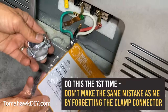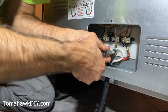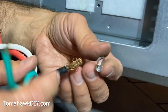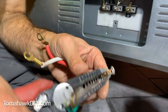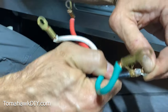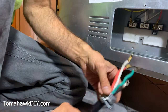Check out the other video showing how to fix that. So here's this clamp connector — this Romex strain relief. I'm going to need to remove all the wires here so I can get this strain relief in place through this hole. With those off, I'm going to pull this out. I'll take my connector here and work it onto the wire. Don't worry too much if a couple of the finer wires come out. I think that's on there pretty good. Now I just need to nip off some of the loose wires. I'll fish the wire through, like so, and check my length on it.